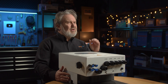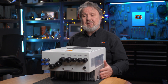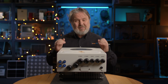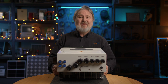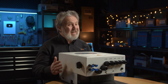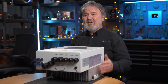It can do a very short peak for 10 seconds of two times its rated power — so 10 kilowatts for 10 seconds. That is really impressive. Why is that important? Many loads, like particularly pumps and motors, have a surge rating when they turn on, and you need a bit of headroom in your power to be able to start those appliances. It's a single phase inverter, and it's got awesome efficiencies: maximum efficiency of AC to DC conversion is 97.6%, and its MPPT efficiency — the DC to DC efficiency when connected to the DC bus and charging batteries — is 99.9%. Not much room for improvement there.